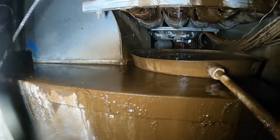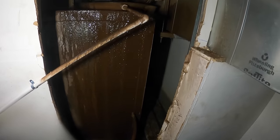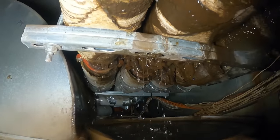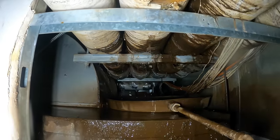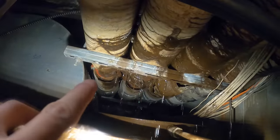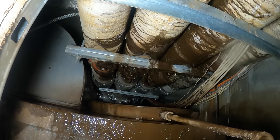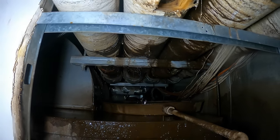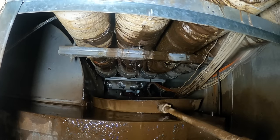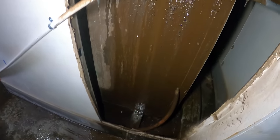The problem is it looks like this leak got worse and now there's just water spilling everywhere. A ton of bacteria here — it's really gross — so we're going to try to do what we can. We busted down this wall last time, opened it up to see if we can possibly get a little bit of access in there. It's a very difficult spot. It's leaking — they have victaulic tees, there's victaulic couplings here, you see little red couplings — so it's leaking at the threaded part. The pipe inside — the steel pipe, or iron, I think it might be iron or steel, black pipe basically — it's just deteriorated, eaten up, and started to leak.